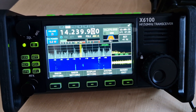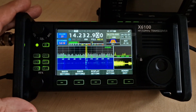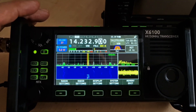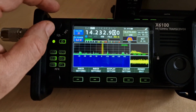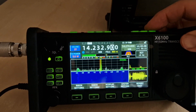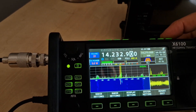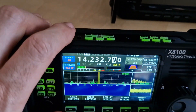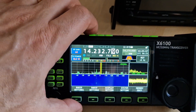Okay, bye for now, 73, all the best. There you go — it's up and running on a 20-metre wire with a 9-to-1 balun. I haven't tried tuning or anything yet. It's on full power at the moment. Let's hit the tune button which is on the top — ATU. Turn it on and hold it. There are up and down arrows on top to go down the band.